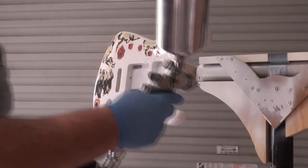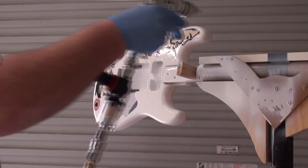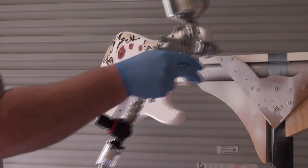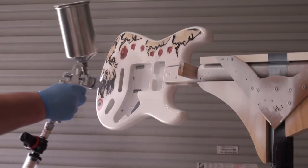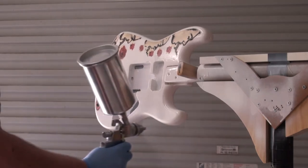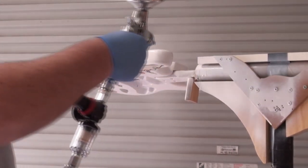Seeing that chain of attachments under the gun reminds me of how bad that situation had become. So the first attachment is a pressure gauge, so I know how much pressure I have at the gun. I can't get rid of that one, but the next one down is an oil and moisture trap. Under the water trap is the adapter required to attach the hose, and that hose is about 1/2 inch thick, so it's quite heavy. I believe this thickness of hose is needed to provide sufficient airflow, but I could buy a lighter, more flexible hose.